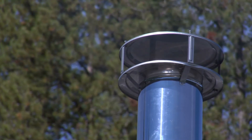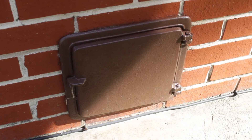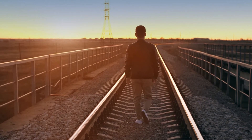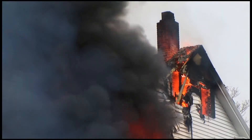This is a serious problem and it needs to be addressed to the homeowners. They need to have a rear-access clean-out door cut into their masonry chimney to allow for cleaning. They're going to say things to you like, 'I've had this chimney cleaned for a million years and no one has ever told me I have to have it done this way. You're trying to rip me off.' This is when you show them the building codes and walk away. If you clean this chimney and all the creosote piles on the smoke shelf, then one day that creosote is going to catch on fire.